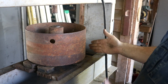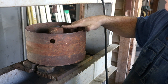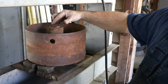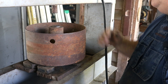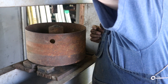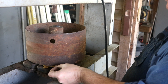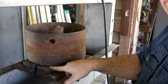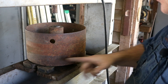Let me talk about my setup. I've got some plates underneath here. There's a hub — it sticks out a bit farther than the outside rim. When I'm pressing on this, I want to put all the pressure on the hub on the bottom side. I don't want to be pressing on the rim of this pulley because the spokes inside could easily break. We want all that downward pressure on the hub. There is a gap up underneath here with some spacers — I wanted to show you that clearly. I did this once and in the video it looked like I was pressing on the rim and got a lot of comments about it, but there was actually a gap. We're not pressing on the outside.